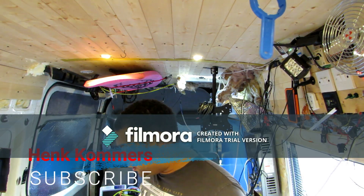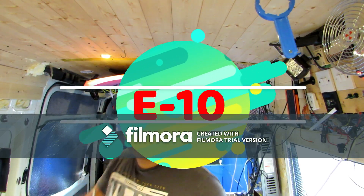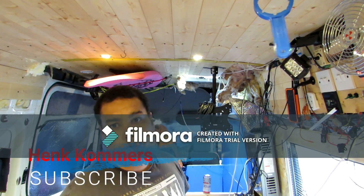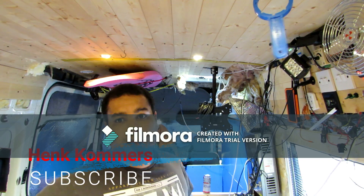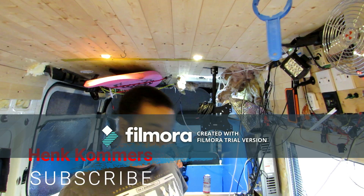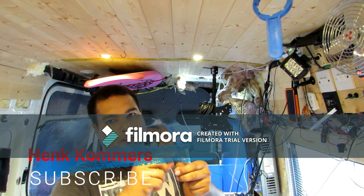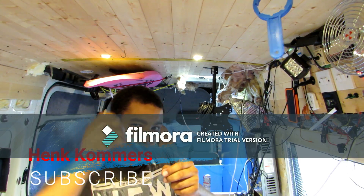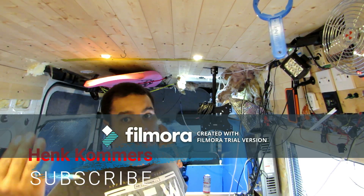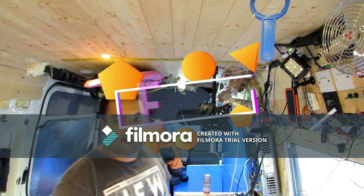My other code was E10. I'll put the helpful channel's link down because I'm no expert on these diesel heaters. E10 was a fuel line blockage. Obviously when you get your unit it's already been tested and had fuel in the pump. When I undid the pump — it's got a little screw at the top — I opened it up and found a little filter inside with black bits in it. I took the black bits out and the fuel started flowing correctly.